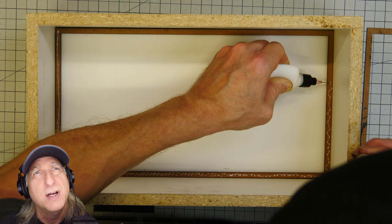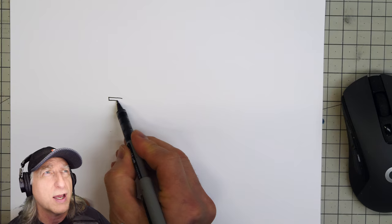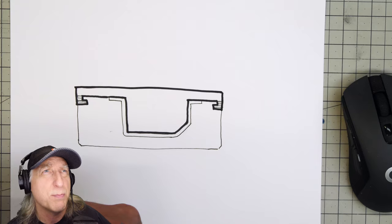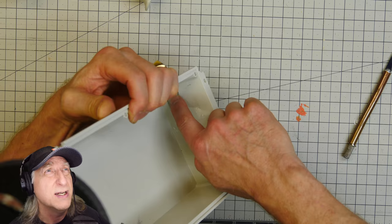I use these laser-cut keys 360 degrees around. In this case the two top pieces of cardboard are thicker than the two bottom layers, and that's going to give me a locking mechanism. Here's a section of the part and a section of the mold — you can see my four layers of cardboard. This basically gives me a mold that locks onto the bottom half of the mold on the outside, giving me two pieces and a self-locking mold. They line up perfectly every time and I don't need to do anything with keys.